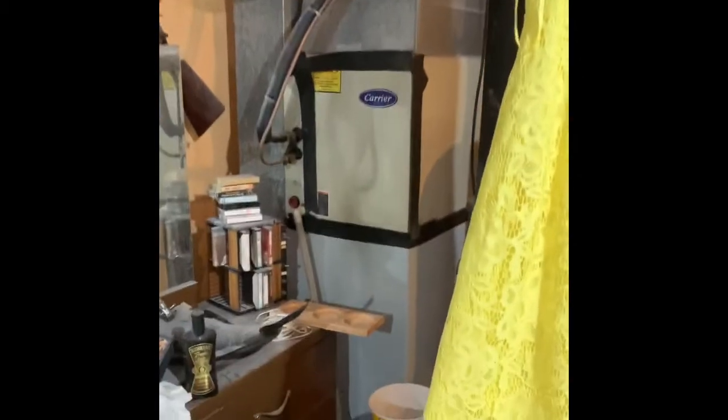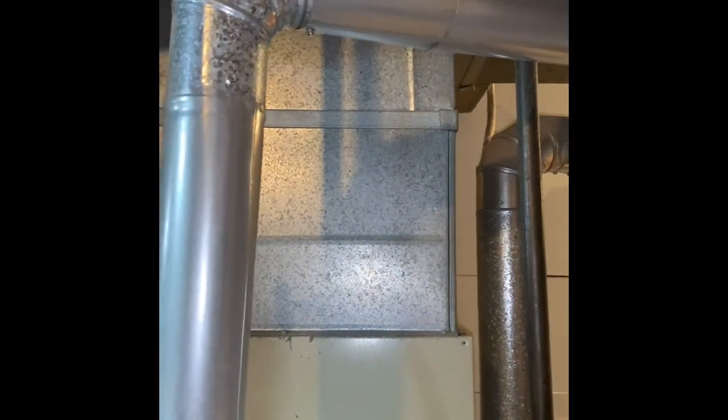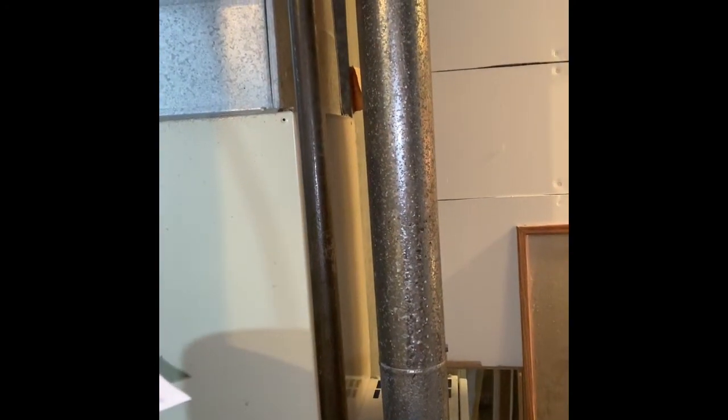New line set. The oil drain is here, and then a 505 we have to put on the supply. We may have to build some sort of coil box off the back of the coil or the ductwork itself to mount it to, just because we're going to run out of space when everything shifts over towards us.